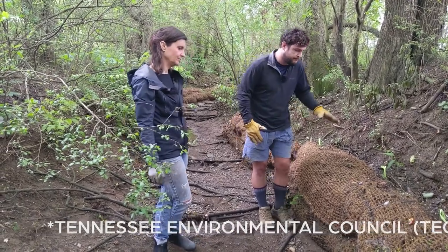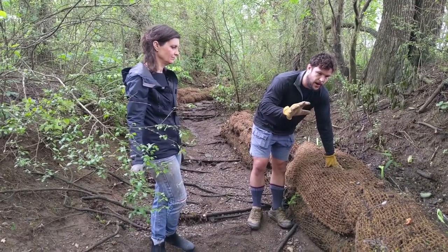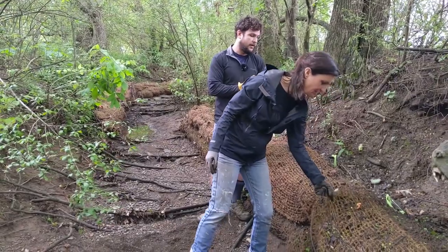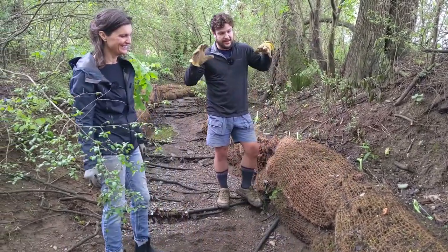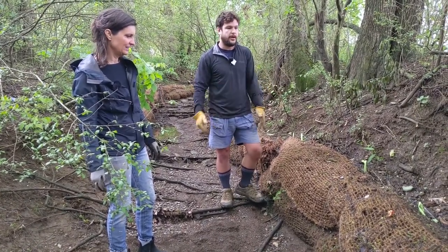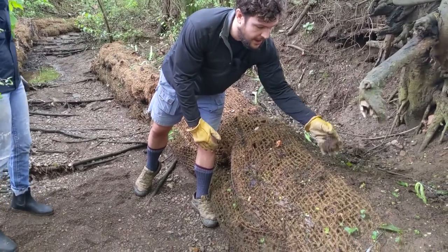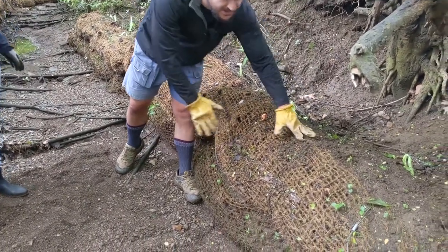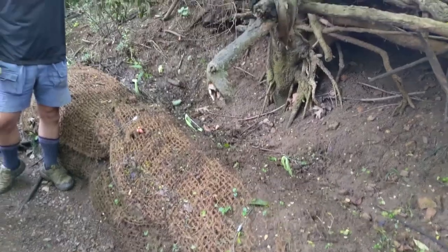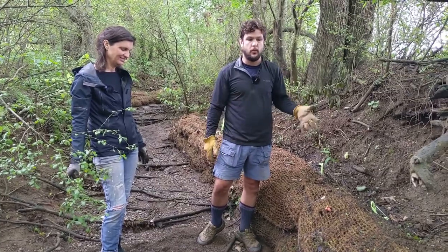Basically what we're doing is we're putting — this is like a fabric, like a coir or a jute fabric wrapped around cedar trees. It looks like a sisal rug that you might put in your house with a really loose weave. What we're doing is anchoring these into the bank. They're going to hold for about four or five years before they degrade. But before they degrade, you can see over time they start to fill in with sediment. As this bank continues to erode, it drops sediment — as the stream rises up and then drops down, it leaves sediment behind. So we're creating an extension of this bank, getting it sloped properly, and then we'll come back in and plant native vegetation along the back of it to kind of take over what anchoring it was doing.